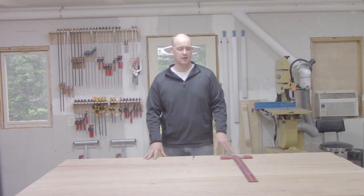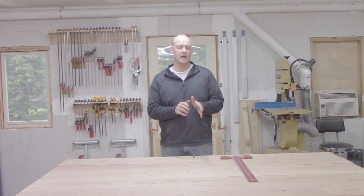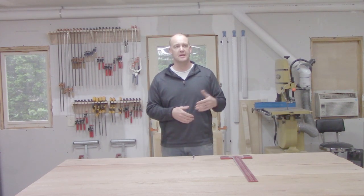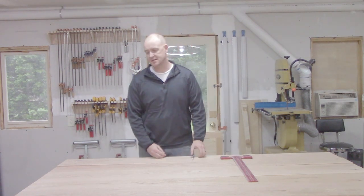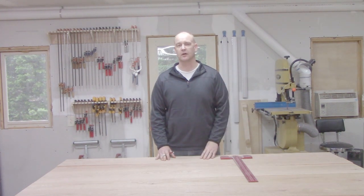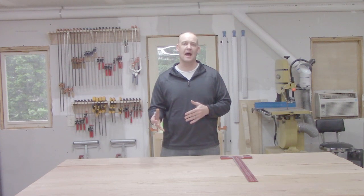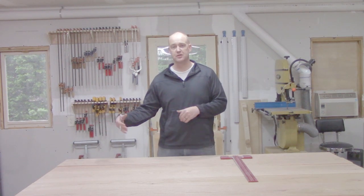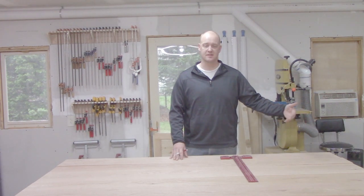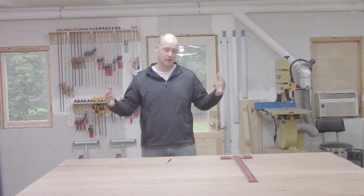I do that for one very specific reason. When it comes time to glue up the table top, you can try to get one end perfectly flush, but something happens in the clamping process. As you start to tighten the clamps, maybe one of the boards shifts and it's not perfect, and then you've got to sit there and try to sand the edge. Anybody that's sanded edge grain knows that takes a lot longer and you're going to get some unevenness. So I just take that out of the equation. I make it a little bit longer — usually about a half inch to an inch over. When the glue is dry, I'll cut a very small amount off one end, measure from that end down to the distance I need, say 72 inches, mark a line, and take my track saw and cut that nice and smooth. So then the table will be perfectly square and even.